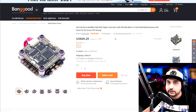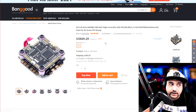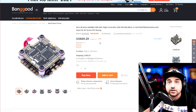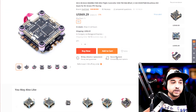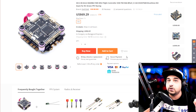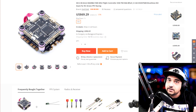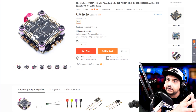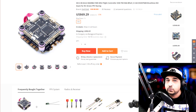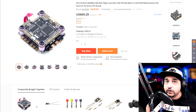This is the cheapest on the list. You can find cheaper — they're somewhat decent — but this has proven itself to be an insane value. It's not because of the flight controller, it's actually because of the ESC, the electronic speed controller, which controls your motors and sends the power delivery. It's one of the most crucial components because some ESCs have noise and can give you an absolute nightmare — voltage coming back into the system, frying components or causing weird twitching you can't fix without adding a low ESR capacitor, and that doesn't always guarantee a fix.